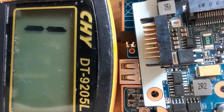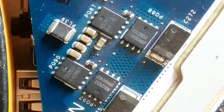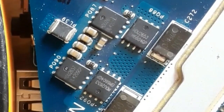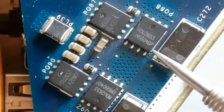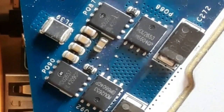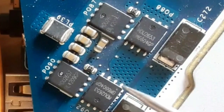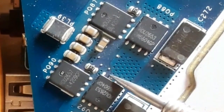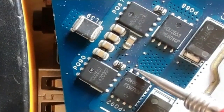This is a good MOSFET. Now let's look at an 8-pin flat MOSFET. This type contains three pins for source and four pins for drain. You should always locate pin number one using the dot or notch. Pins one, two, and three are source; pin four is the gate; and the remaining four pins are drain.